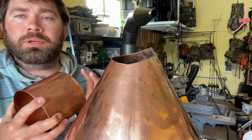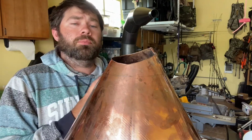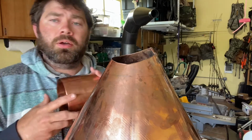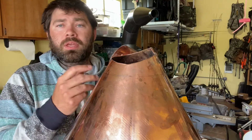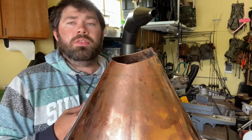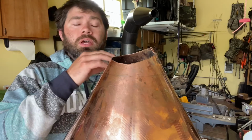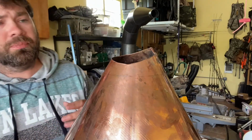One is going to be your cap, the other one's going to be the collar for your cone. I already went ahead and soldered this together. Basically, I just made a 1/2-inch lap and soldered it together. The other one should be right around the same, but you're going to want the other 6-inch piece to be able to fit in there, but we'll cover that in the next video.